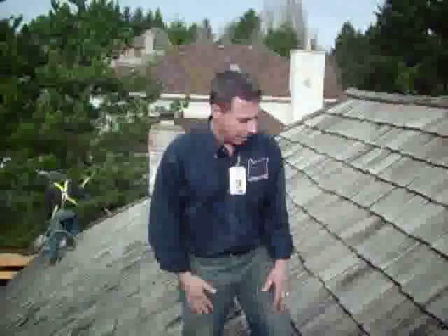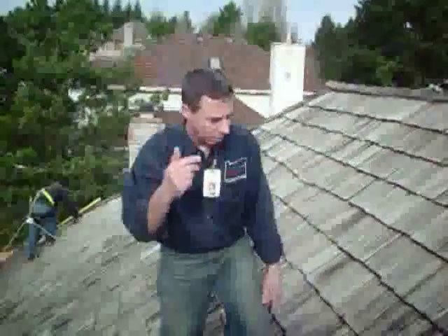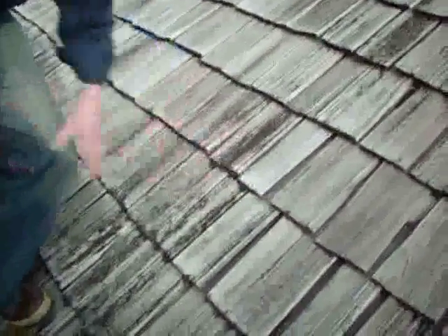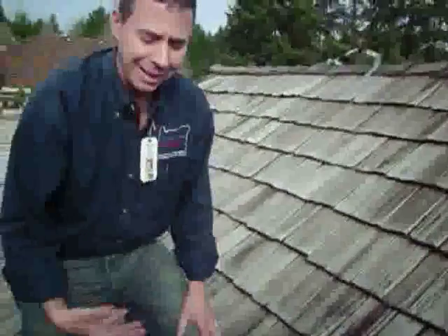On the west side, that's where we're going to have a lot of these erosion holes, along with the south side. Coming a little closer, what we're looking for are these erosion holes. Now, if you only have a certain amount of them on the west side or the north side or wherever we're working, we can do the repairs on these roofs. A lot of the times, these southwest sides have so many erosion holes that we have to replace them.